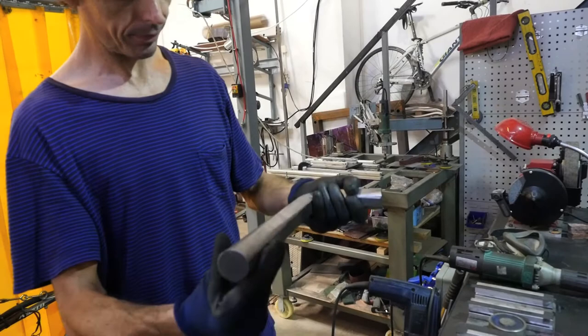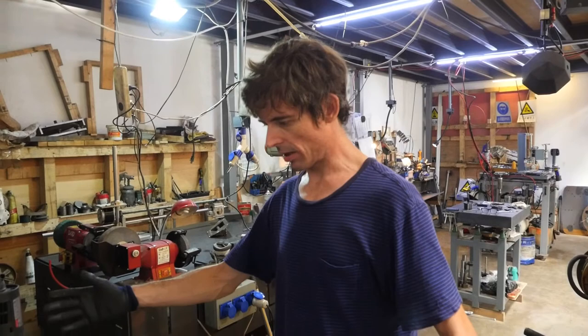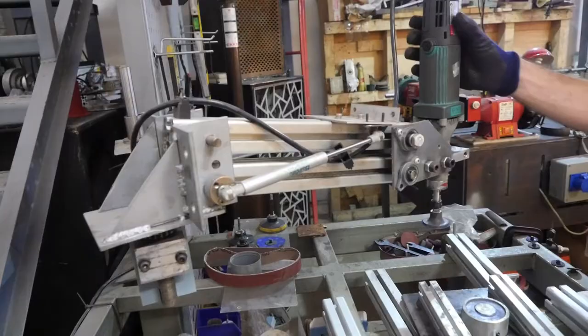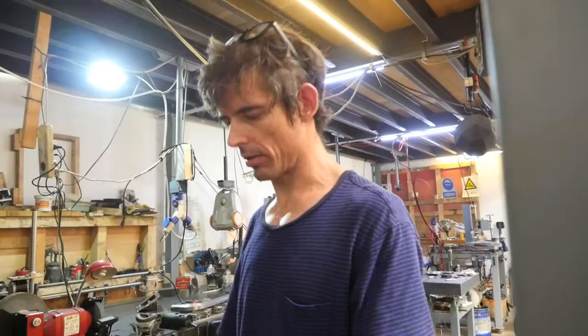This was a very big Allen key. I thought it would be interesting if you could smooth out the features on it so it kind of rounds out. I've made some sculptures like this before. This station here I can do sanding with these die grinders. You can fix edges and holes and all sorts of things, get things perfectly flat. This has magnetic chucking so you can get your part, put it on here, lock it, and then deburr your part. It works great, saves hours.